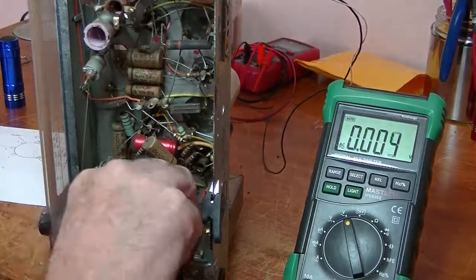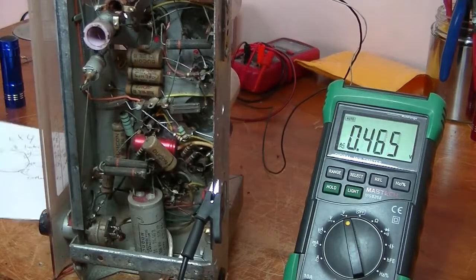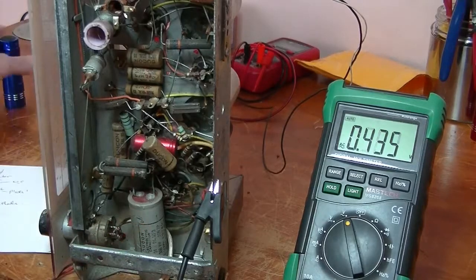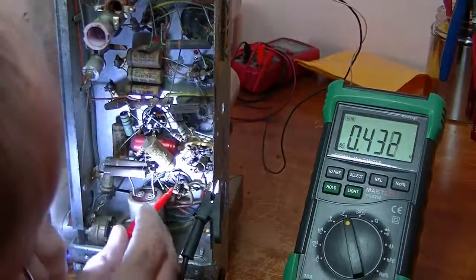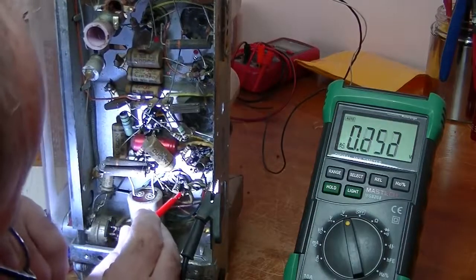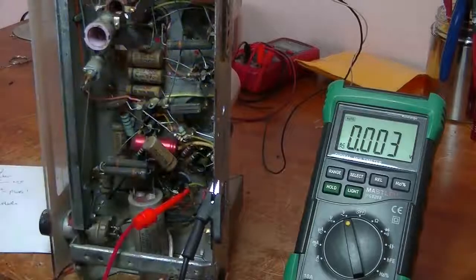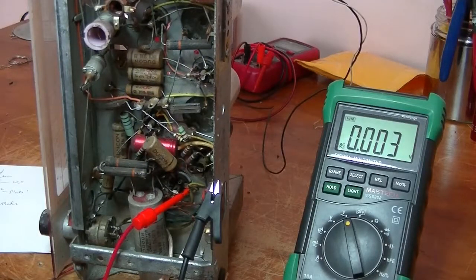Now we'll go to the heater. And again, I've just turned all the power off. And it's pin number 3 or pin number 4. Let me count: 1, 2, 3, 4. No, I'll go on pin 3. Power on. Give it some volts. And up she goes. So that test tells me that the power supply is spitting out 3 different voltages. So, I think we're good to go.